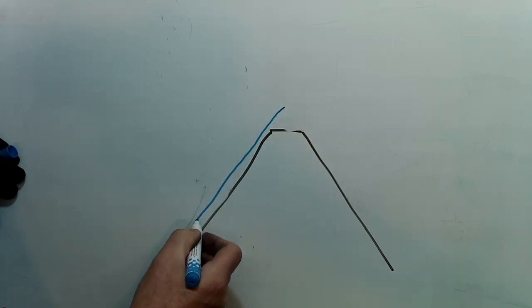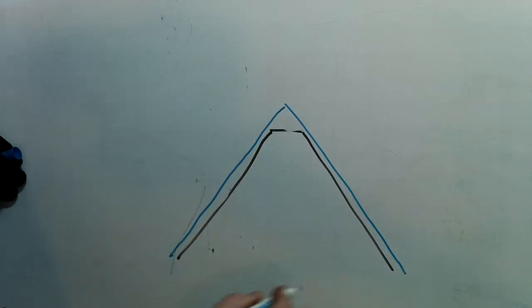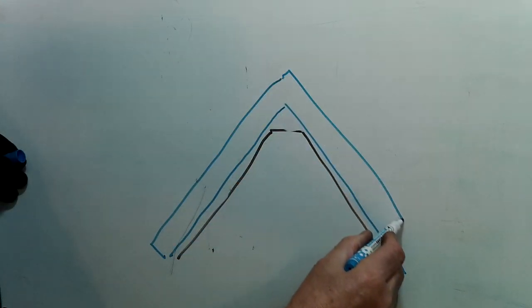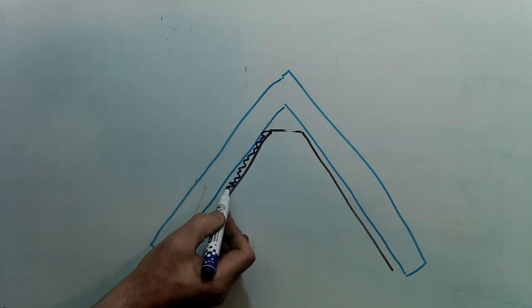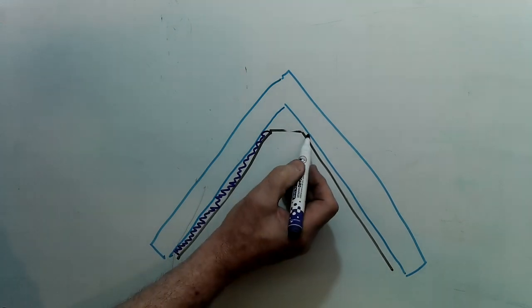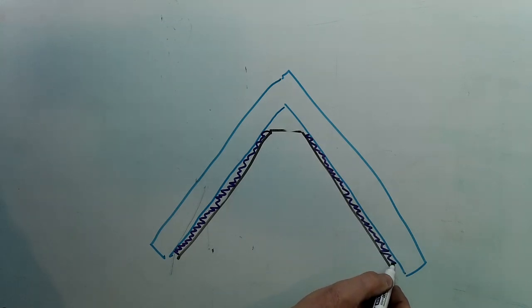This meant that I had to maintain some sort of height, and therefore profile. That meant that I needed a method of maintaining the same level all the way along the slide. But because I've already reset the top faces, I found, by trial and error, that I needed some 1.5mm diameter rollers. Each of the aluminium angle sections were more than long enough to span the worn areas to keep them on an even keel, so to speak.